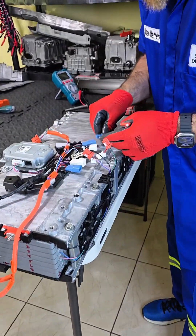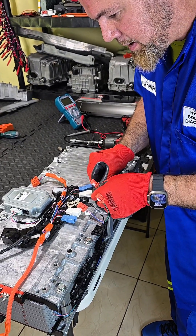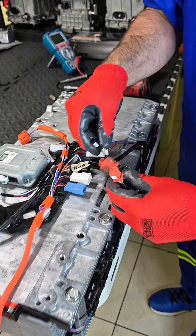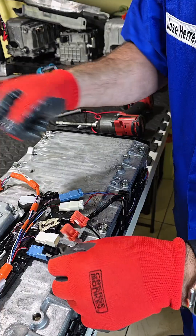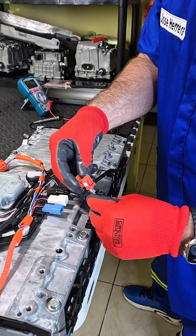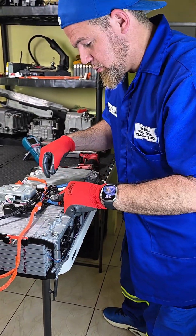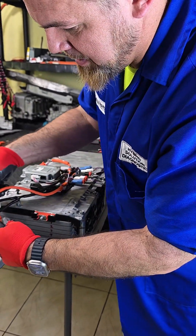We're going to connect the main unit: the blue temperature sensor, the white temperature sensor, and this one is the voltage sensor because it's in orange. Click — it goes. The problem was this: the voltage sensor was connected here and the temperature sensor cable was misconnected. This is 30 volts — and this is how it's supposed to be, orange to orange, plus these two as well.